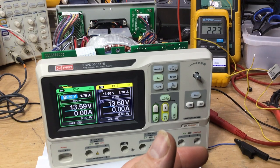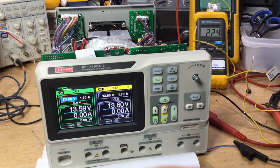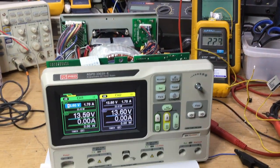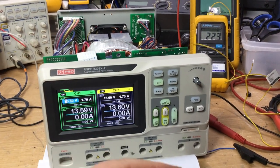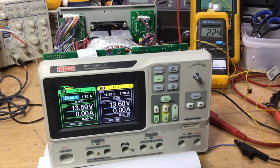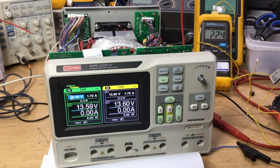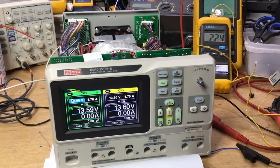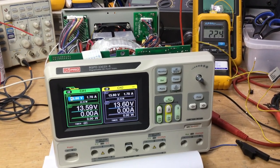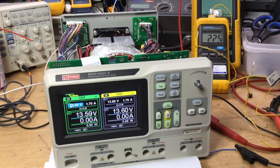So I think it's just a design oversight. I think the person who has designed it has assumed that the temperature would be cool within the unit with a fan, or maybe not taking into account the small compactness of the bridge rectifier and its operating temperatures. So yeah, it will obviously cause it to fail over time, probably running for years at that on the bench, it'll cook itself to death and then obviously fail. So I'd be interested to see how many other units like this have failed with that fault.